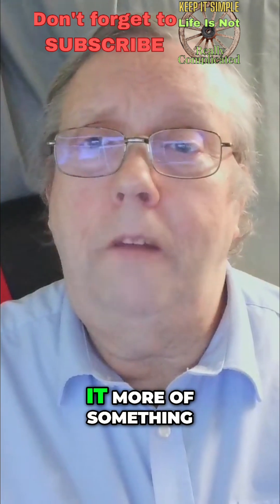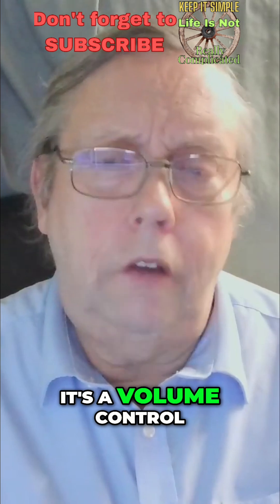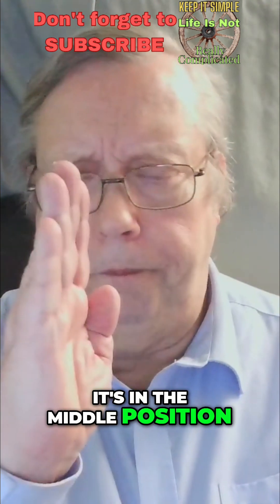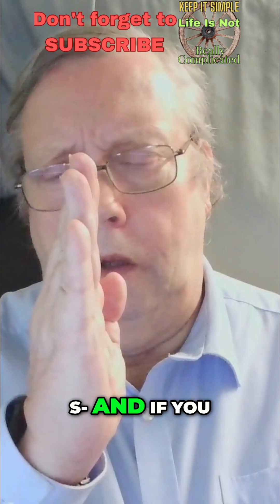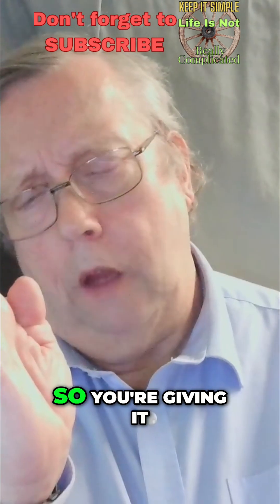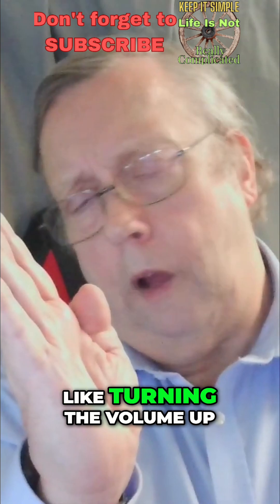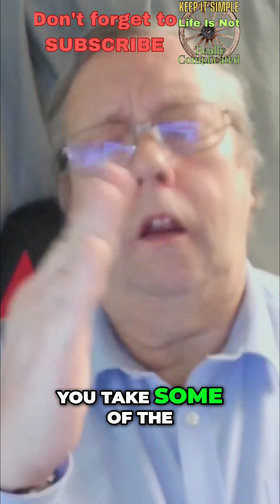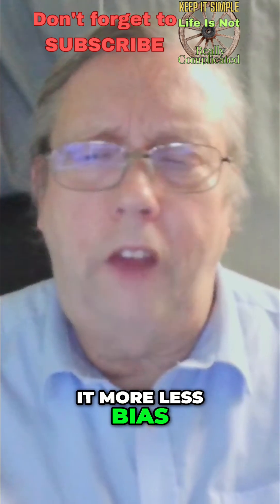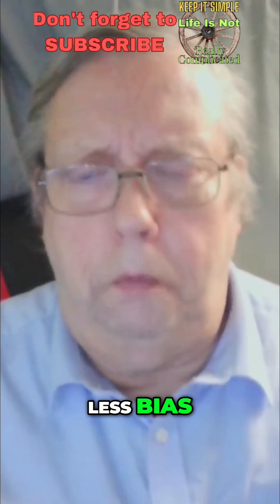They think if they turn it to the other side they're giving it more negative bias. But you can't give it more of something you're taking away — it's a volume control. The middle position is zero. Turn it one way and you're giving it more signal, like turning the volume up. Turn it the other way and you're taking some of the signal away. You don't give it 'more less bias' — you just give it less bias.